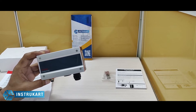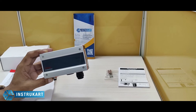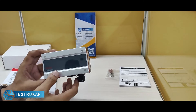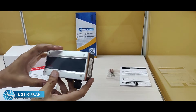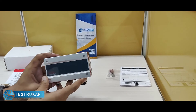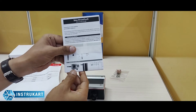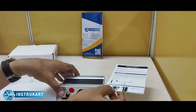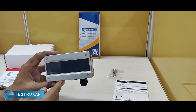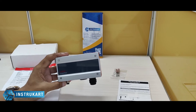It has automatic sensor test and drift compensation, and its precision is dependent on the probe and adjustment profile used. This also comes in a duct mounting version, as shown in the instruction manual. It comes in a three-wire or four-wire operation with freely configurable signals.